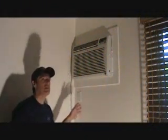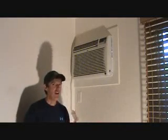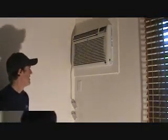Okay, this is always about safety first. I want to be safe rather than be sorry, and I hope you do too. Here's one more tip for you. Where your electrical sub panel is, you've got that breaker off. I want you to mark that. Put some masking tape or something around it now that it's shut off, okay?